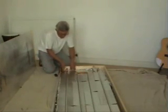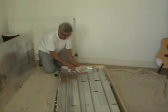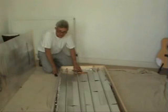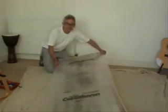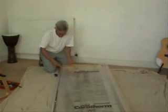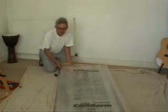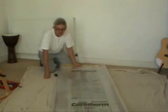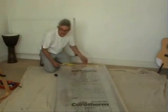Between the back of the box and the fins, we've also got this super insulating foil with a fleece lining. It's very highly efficient insulated material so that it keeps the heat in the box. And then on top of this, once it's on the roof, we'll have this polycarbonate sheet which sits on the top. It's held in place with an aluminium strip along the top edge of the box, screwed onto the ends, and then we have some specially made plastic buttons which will go along that edge to hold it in place, and we'll silicone underneath each end strip so that we don't get wind driving in the end.